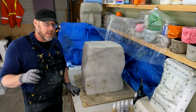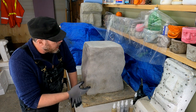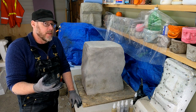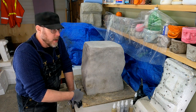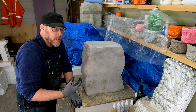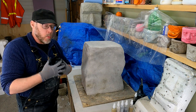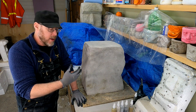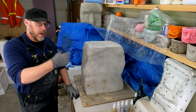Let me give you an example — see that very dark coloration spot? Most of it isn't that color. As it dries, you'll notice it goes on very dark because it's three parts water to one part paint, so the water evaporates or soaks in and you're left with a very slight coloration. When I see a lot of darkness, that indicates maximum hydration — the concrete is saturated in that area. I wouldn't hit that area with more paint because if it's already saturated, you get color bleed instead of individual layers. I'm going to do one more light layer but then leave it for a good hour to dry before continuing with more paint layers.